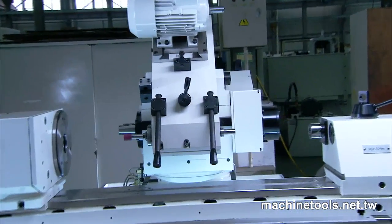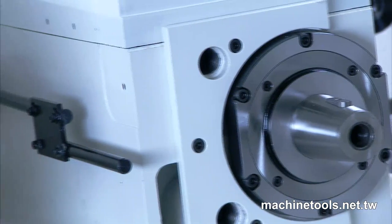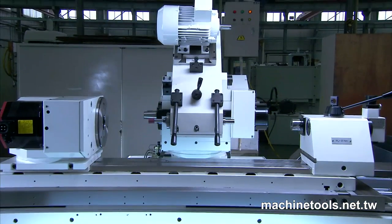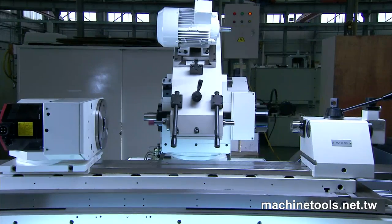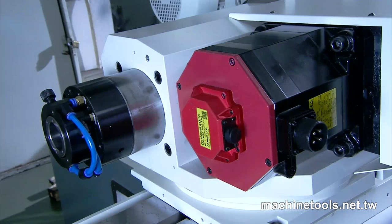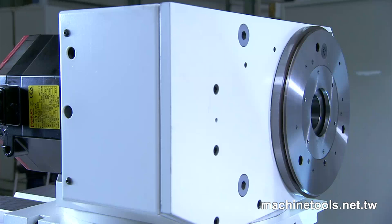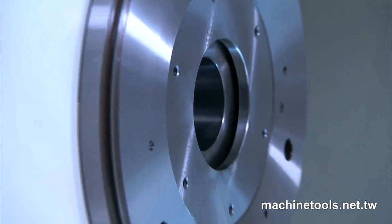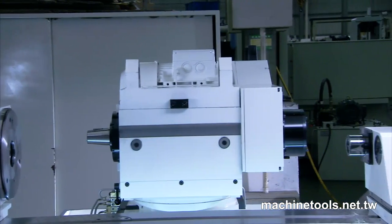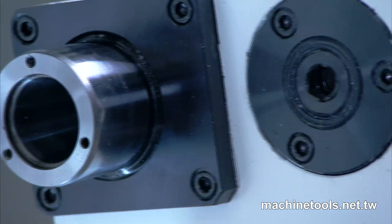The spindle assembly is supported by ultra-precision angular contact ball bearings with a dynamic seal and internal cooling for superb surface precision and positional accuracy. The headstock on the KDC 2980 uses a highly specialized German bearing coupled with a servo-driven timing belt. This unique combination guarantees positional accuracy and makes this design perfect for indexed surface grinding operations. The tailstock also features dynamic hydraulic locking for simple, efficient workpiece holding.